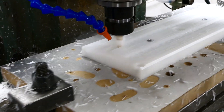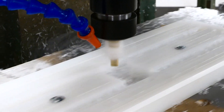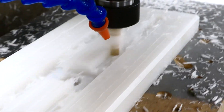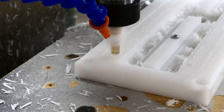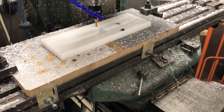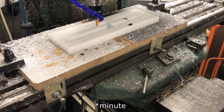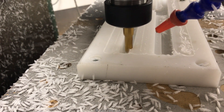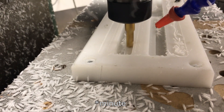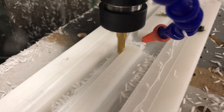He's already designed a new solution for the doors, which is what he's trying to machine here out of some kind of plastic. It's a great material to learn with since when you mess up it doesn't cause the destruction that steel or aluminium can. All moves are done with programming — some manual g-code and some generated from Fusion 360. He tries to write a lot by hand to learn all the functions. The mill now has a fast travel of around 2500 mm per minute, but he's going to see if he can push that further. He's doing the milling at 600 to 1000 mm per minute and around 1700 RPM, though this spindle normally only does 1400 so he doesn't want to push his luck too far.